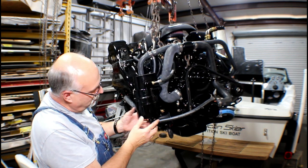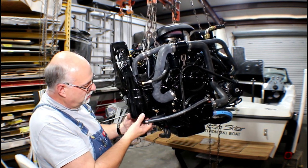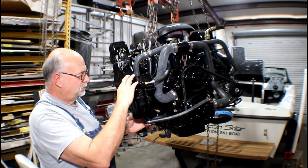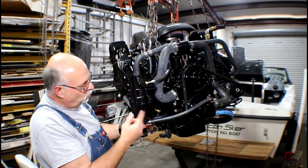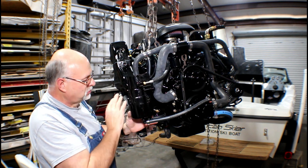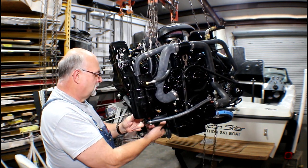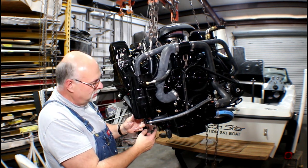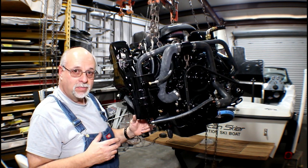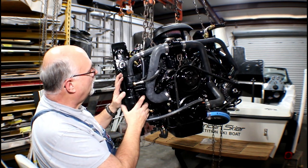The bottom canister here — there is a separate canister between it and the actual fuel pump. This contains water inside, but it cannot get in contact with the fuel pump so you don't have to worry about that. The low pressure pump also has water lines wrapped around it for cooling, to keep the fuel cool and help prevent vapor lock issues. That's a Marine Power feature.